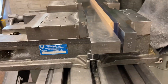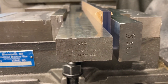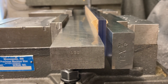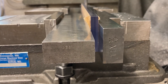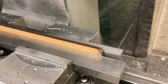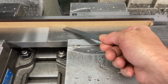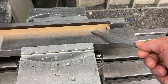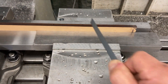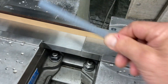I project that solid jaw along the whole length of the part by using parallels. I got a matched set of Starrett 7/8 by 1-3/4 parallels that I'm sticking in the back, using as a solid jaw. And I got these other parallels here, 1 by 2 Brown and Sharpe, basically using as a floating jaw — to put pressure along the whole entire length of the piece, making sure it's banked up against the back jaw and it's not all wavy.